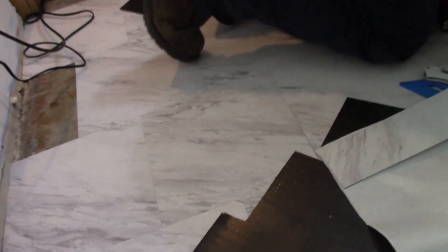Good morning, y'all! We are in the homestead bathroom putting down the floor — thought we'd give an update. There is Justin, and here is the floor. We are starting to cut the trim pieces and the fine-fit pieces. This is our third time putting a pattern down. It's not that hot in here so the tiles aren't wanting to stick, but we plan to use a heat gun over the tiles to get the glue to activate. We have no heat connected to the homestead farmhouse yet, so we have a little heater in here helping us.